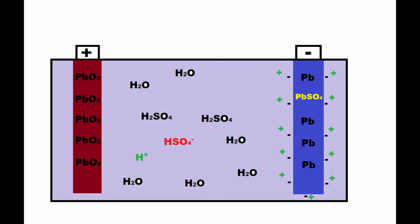The double layer of negatively charged electrons surrounded by the positively charged hydrogen ions also results in the negative terminal — this is the reason that you don't get an electric shock when you touch the negative terminal of a battery. Now let's turn our attention to the lead dioxide electrode, which is connected to the positive terminal. The lead dioxide also wants to react with the hydrogen sulfate ions present in the electrolyte solution, but for that reaction to proceed it needs free electrons — and the only available free electrons are the ones residing on the surface of the lead electrode at the negative terminal, which are not able to pass through either the electrolyte or the casing.